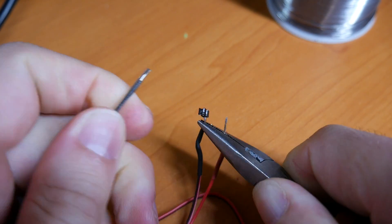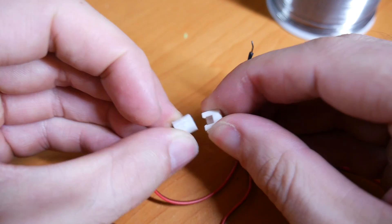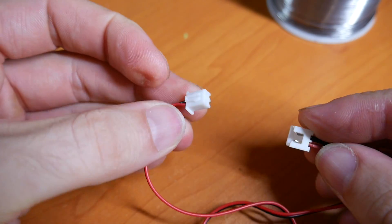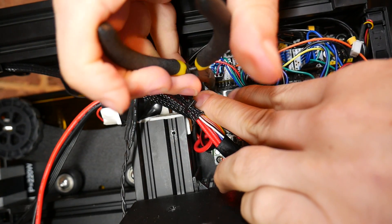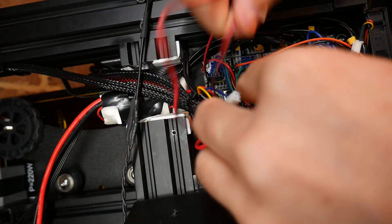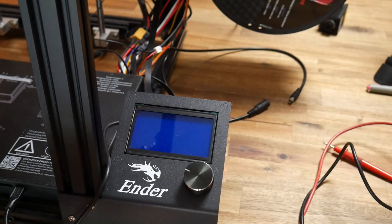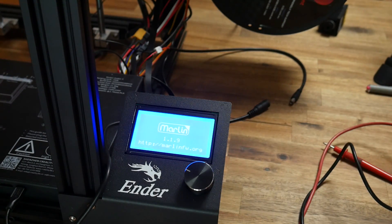We're ready to solder the end of the loom onto the header, and once we've done that we slide down the heat shrink, apply heat, and everything is sealed up. Use pliers to pull off the little plastic spacers for the header pins, temporarily put the two plugs together to orient them, then feed in from behind the two pins to complete the loom — male on one end and female on the other. My Ender 3 with its MKS Gen L conversion has a very hard-to-reach plug for the cooling fan. With an extension cable I can unplug the original, plug in the extension in its place, and feed it out the back for easy access. Note: this fan gets a blip of full power when the printer is turned on, so I strongly recommend unplugging the laser before you power up the printer.